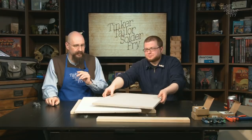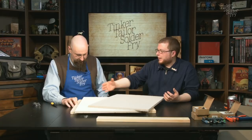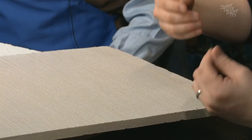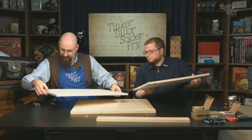With these ceiling tiles, make sure you're not using ones with a badly bashed corner or major damage. They will crumble and chip a little as you work with them — that's fine. But avoid ones with big cracks because once you start running vibrations through it, that's only going to get worse.